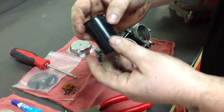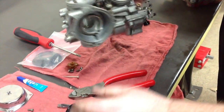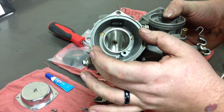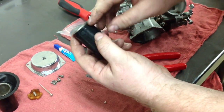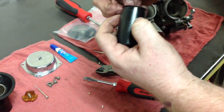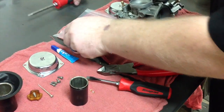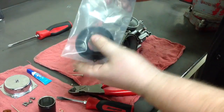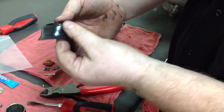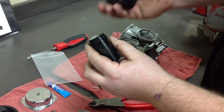When you order from JBM Industries, they want to know a couple of things. They want to know the outside overall diameter of your top — from the outside edge to the outside edge. On mine, they're 72 millimeters. They also want to know the overall diameter inside the groove, because that's where your diaphragm is going to seat. On this one, that's 32 millimeters. When JBM Industries sends yours, they'll come in a Ziploc bag in a pair. The reason you remove those old rings is because this new piece — they call it a tire — is the exact measurement to fit in that groove nice and snug.